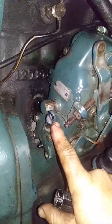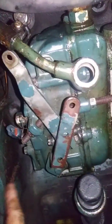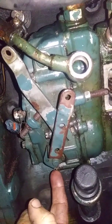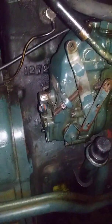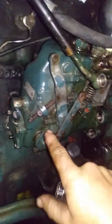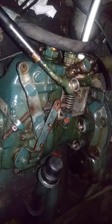You need to drain the fuel and check the oil in your governor and in your pump all the time. I actually had to poke a hole through the sludge that was in there — this is a 50-year-old machine that had never had the oil drained, I'm sure. Use good quality motor oil. This pump does not get lubrication from the engine and will seize up, so take care of it and it should treat you pretty well.